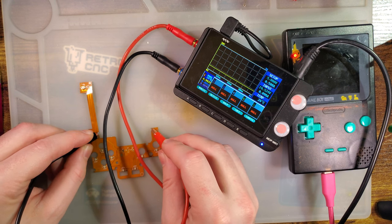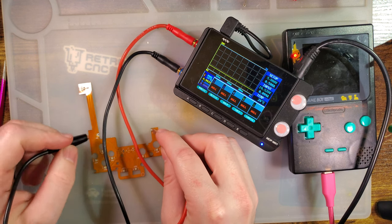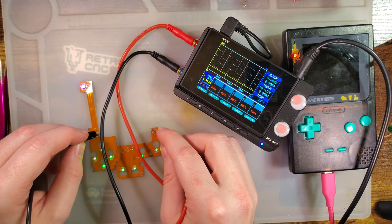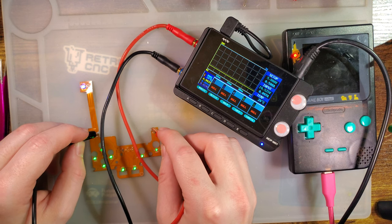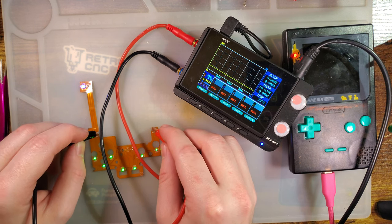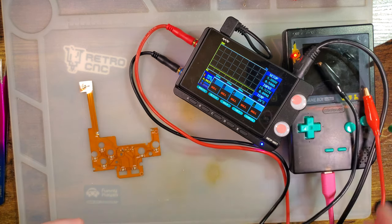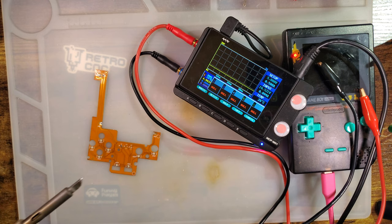It's not very bright, but that's probably a function of this resistor right here. We could probably swap that out with a lower value and get brighter LEDs at the cost of more power usage. The reason I wanted to use my power supply on this is to take a look at the power usage. At 5 volts, this thing pulls a whopping 4 milliamps, which is incredibly low — so low that I may have to take back my earlier statement about using it in a modified pocket.